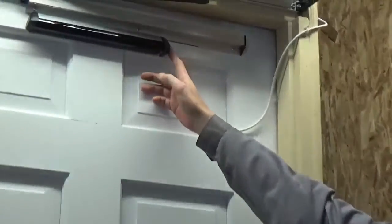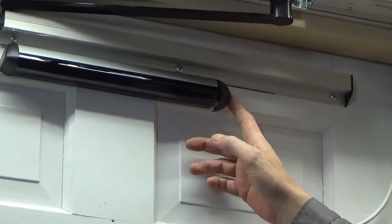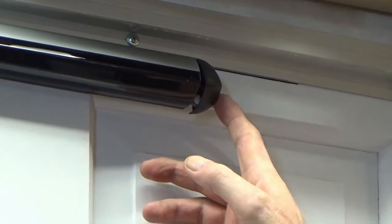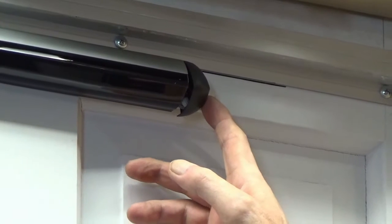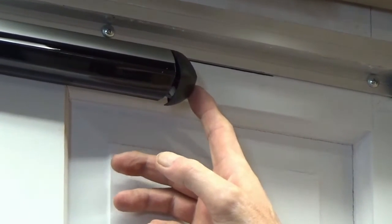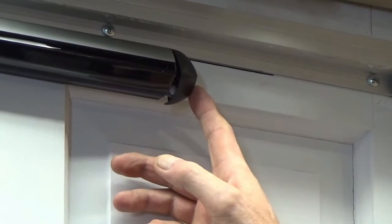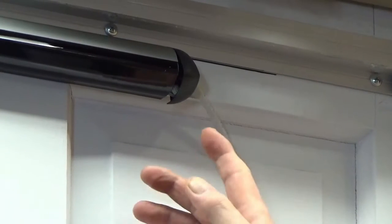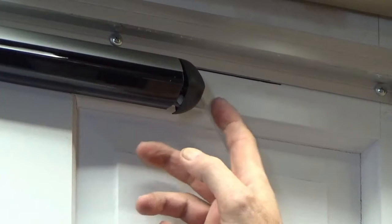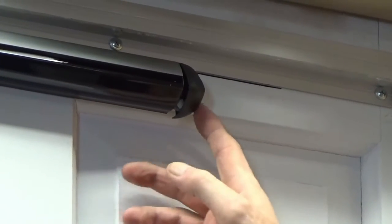As you may recall, I used wire nuts and there's not a lot of room in there. I really suggest using a butt end splice or soldering the wires — the wire nuts are just a little too big. You're going to have four of them in there, and mine are on the small side but they're still too big, and my end cap doesn't fit right because of the wire nuts pushing on it.